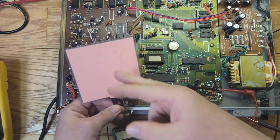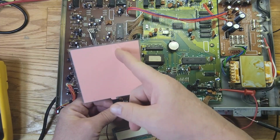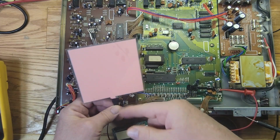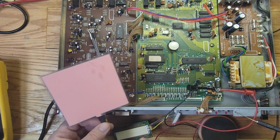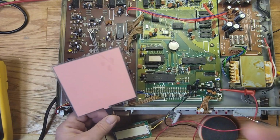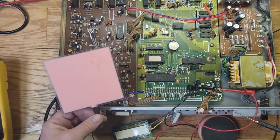Your cut has to be done with a sharp blade, because if your cut is rough, you're going to see black spots everywhere. So you got to make sure you cut it with a sharp blade, and then cover the cut with some tape. So I'm going to cut this down to size, to match this size here, and we'll come back and try it out, see if it drops less voltage and gets brighter.